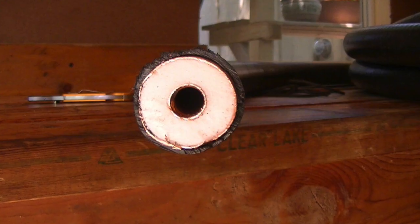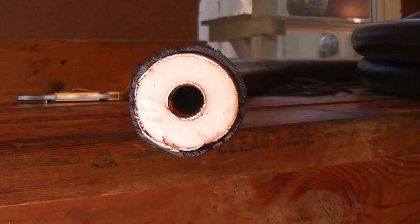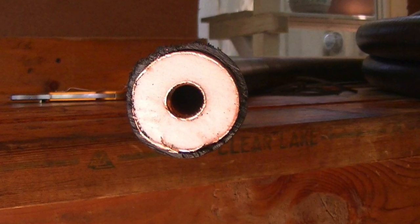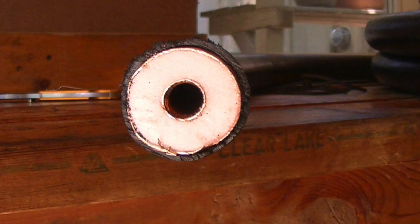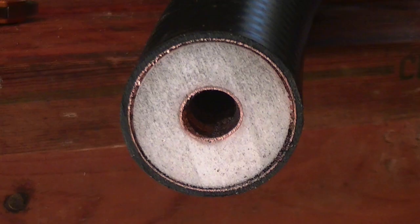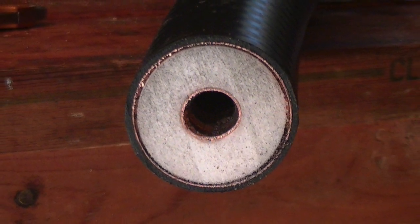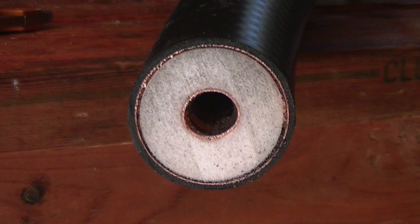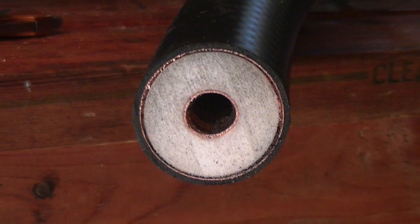Take a look at the end of the hard line. Take note of the damage done to the copper shield. This happens from pushing too hard upon the hacksaw. This was done as we cut it off the large spool to the proper size and length that we needed for this project. The next cut shows a smooth, light touch with the hacksaw and a clean, workable surface, so be sure to use a light touch with the saw.